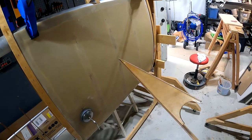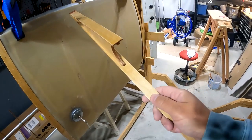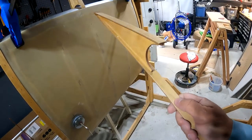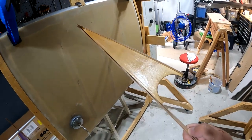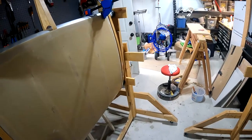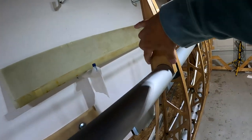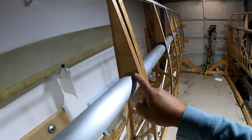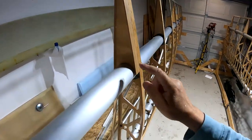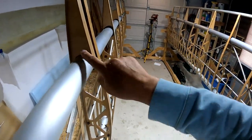I'm at the fuel tank bonding stage and decided to work a little bit ahead and varnish my number two ribs before installing them, because on the upper side of the cap strips you can't see anything and don't have access to put any varnish on. I put on a nice coat before I left on a trip and sanded it back down. I was ready for a second coat, but first decided to see if I was going to have to remove any wood. When I set these things in here, I discovered I had to remove quite a bit of wood to get them to match up in length and make sure the rib tails were all lined up.